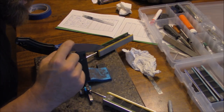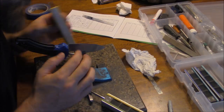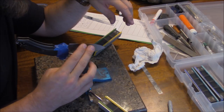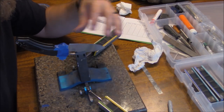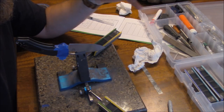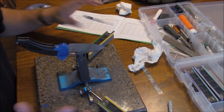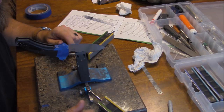I've got a burr along part of it, but I can still see red at the tip and right at the base, so I'll keep going. Periodically I use a paper towel to carefully wipe off the edge so the metal filings are away and I can see exactly what I'm doing. I'm getting pretty close. I'm going to cut the camera and get both sides profiled, then show you some of the back-and-forth single-sided strokes. Profiling is simple — you just file on one side until you literally feel you've raised a burr; there'll be no question.